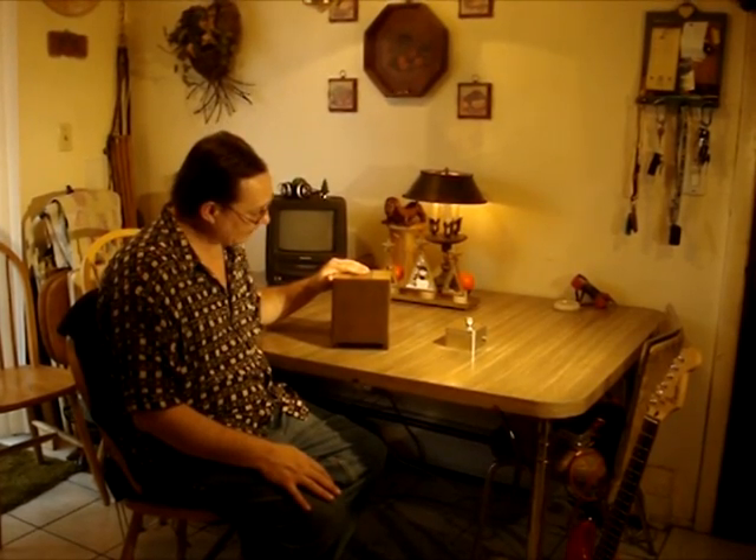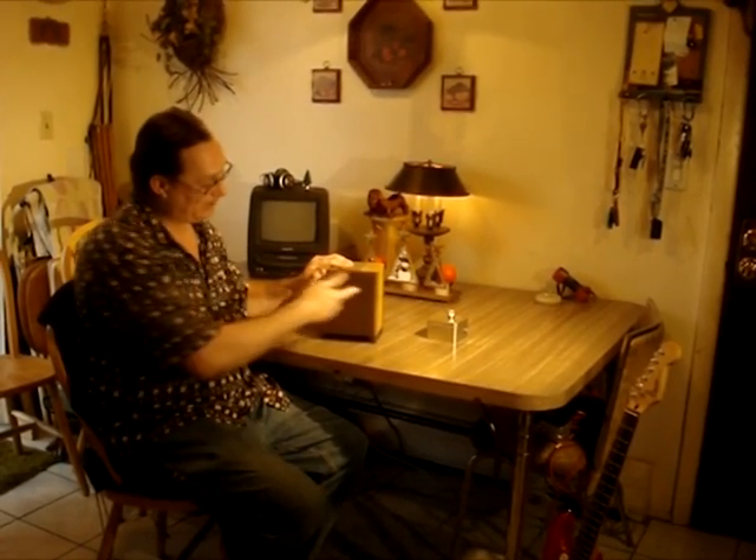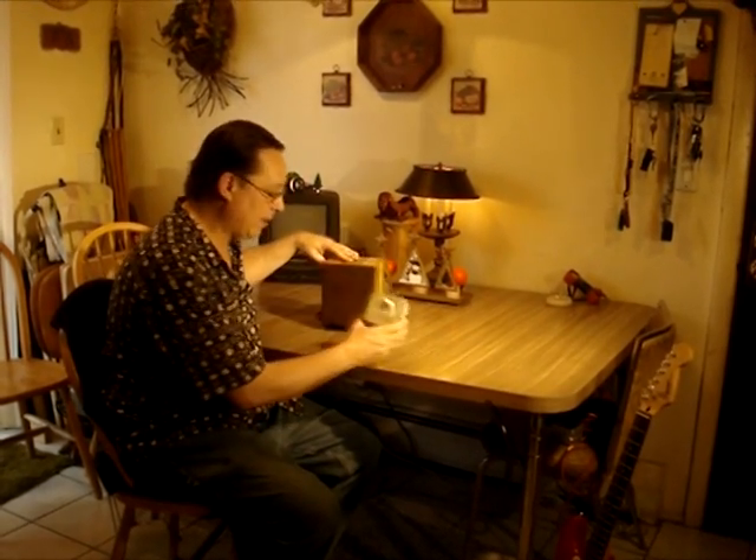I put this together utilizing my old speakers. There are 5 of those little ones — one is kind of a tweeter — and then there's a 4-inch automotive sub-style speaker that came out of my wife's Escort. If you ohm it out, it comes up to 8 ohms with about 6 speakers in here. This was more just an exercise — I was curious how it would sound. Thinking all guitarists have a cabinet with four 12-inch speakers, what would a cabinet sound like with four 1-inch speakers? So this is my homemade monitor and here's the LM386 amp.